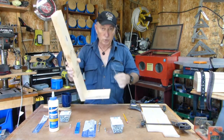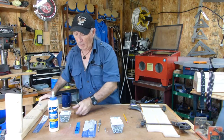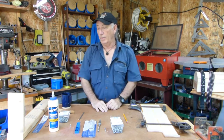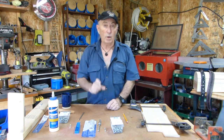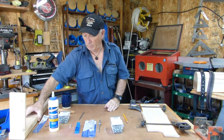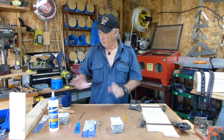It's pretty strong and that was only two screws. We tried the strength test to see how the connection was. I've always liked biscuit joining and other types of connections, but this is really good. The big thing I found was it's all about the screw — get the deepest screw you can, as long as it's not going to come out the other side. Use Kreg screws, because I really didn't see anything else that would fit these pocket holes once you make them.